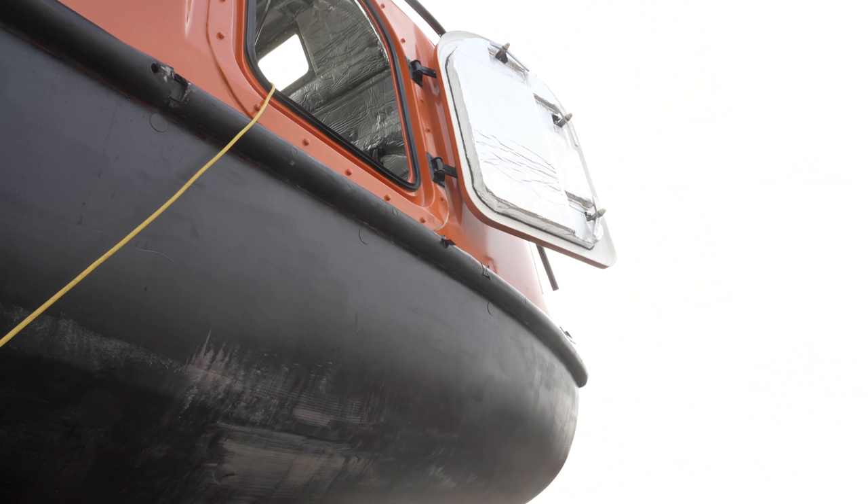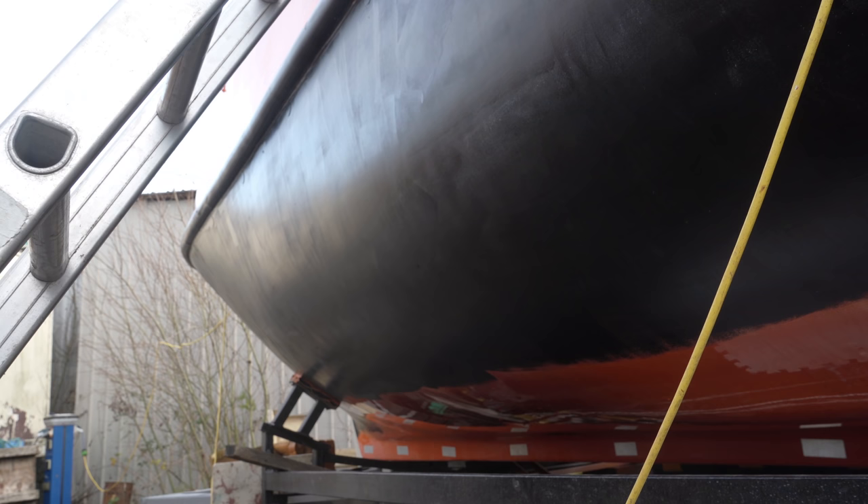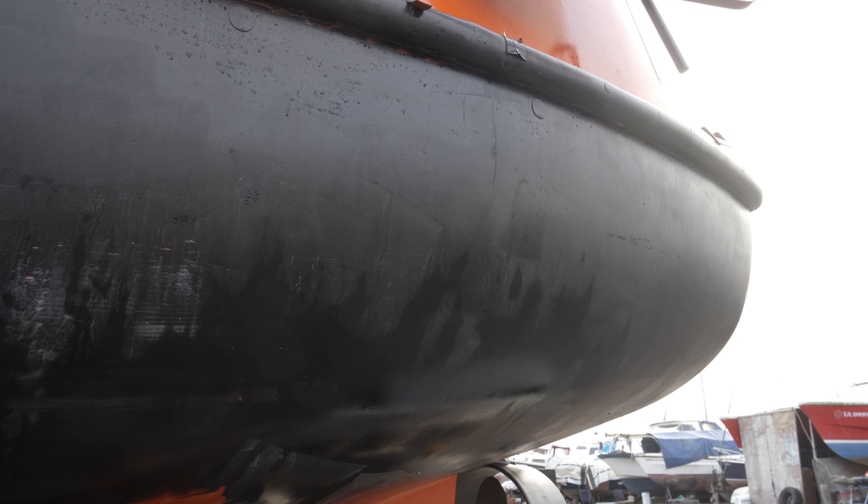The visual state of the lower half of the hull isn't too encouraging. Alan sat moored up against a variety of pontoons and fenders recently, and there's rope chafe and general scrapes. Although it's mostly because this black coating is an epoxy primer with no abrasion-resistant properties — in fact, it shows up marks like a chalkboard, which might be useful for planning future protection. So that's useful, but not very attractive.